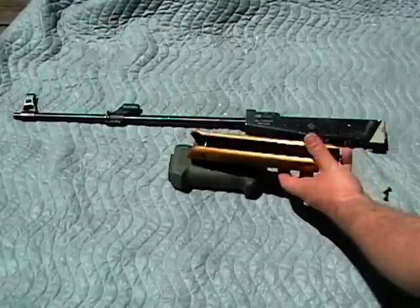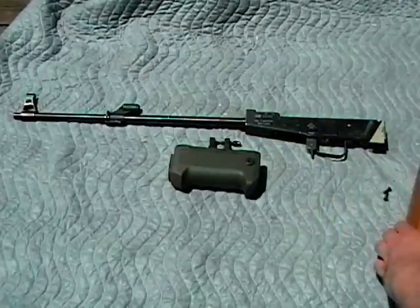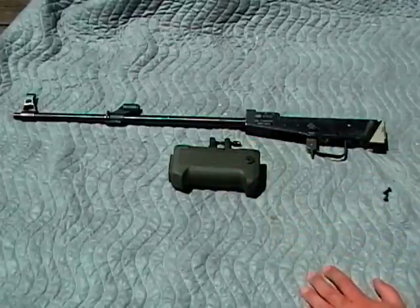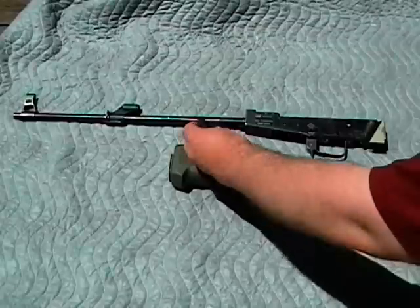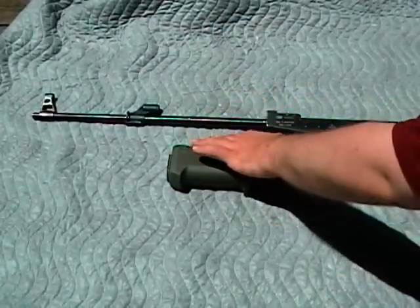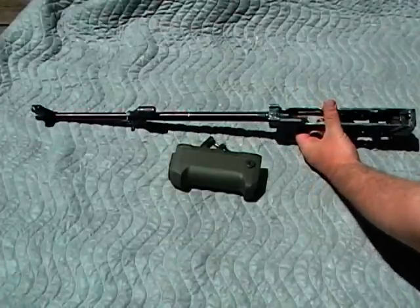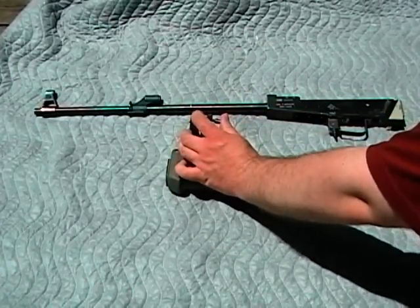As you can see it's remarkably similar to the handguard that came on the Norinco Hunter. This hardware seems a lot more robust — about a quarter of an inch compared to just over an eighth of an inch on that, although there are two of them. This one doesn't need two because it's also got the retainer. Speaking of the retainer, I got the set screws drilled and tapped for 10-32 set screws. While doing that I also dimpled the barrel by leaving the retainer on the barrel while drilling and monitoring the depth of the drill bit — it worked out quite nicely. You've got dimples on both sides and on top the notch where I hand-filed for the bolt on top of the retainer.